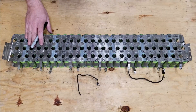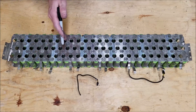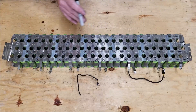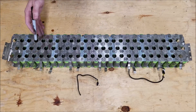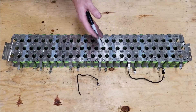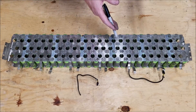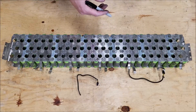If you want a 12-volt pack, you need four groups of cells, so you could cut this into three packs — three 12-volt equivalent packs of cells. You might also want to do a 24-volt pack: take eight of the cells and keep the other four to combine with another four to make another 24-volt pack.